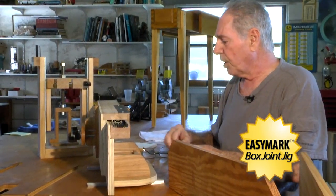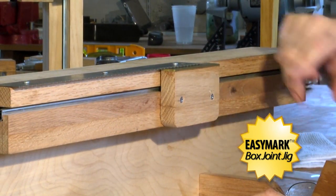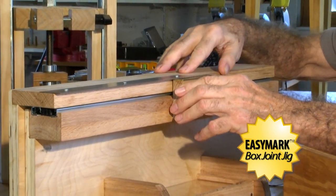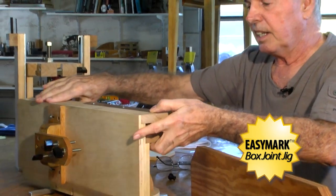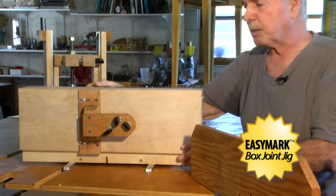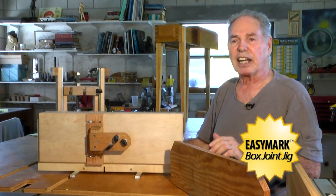You will notice that the ruler is mounted on the movable slide, and it rests on a small plate that is attached to the fixed panel. That small plate has one hole in it — only one hole. But that one hole lines up with all the holes in the ruler, so that when you are moving this, every one of those holes on the ruler will line up with that one hole in the small plate. With your work attached here, if you move this ruler one eighth of an inch, that work is going to move one eighth of an inch. You move it a half inch, the work will move a half inch. That's what I meant when I said the visual part — because you'll always know where you're at, because you'll be at where this pin is. Where this pin is, is where your cut is. You'll never get confused if you're interrupted.